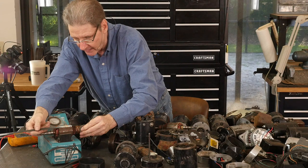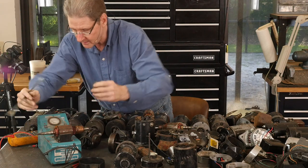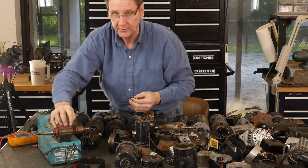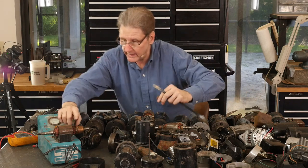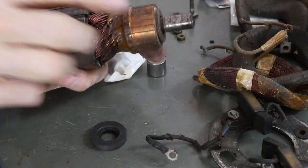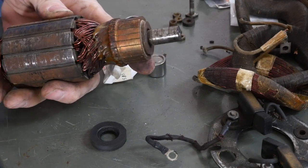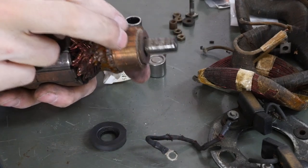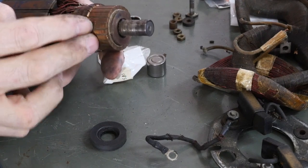See how this thing's hopping now? See how it sticks? And it's hopping. And then there's a meter, and one thing is just checking continuity. Is it shorted? Well, let's turn it off. Are any of these individual commutator segments shorted to the metal frame? That's bad. And then there's another probe with two needles. You can go side by side in a voltmeter, and that tells you how much any adjacent pair is making.